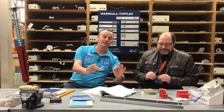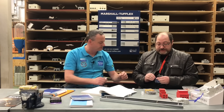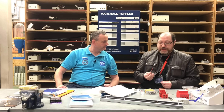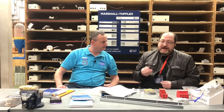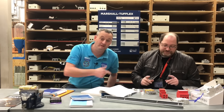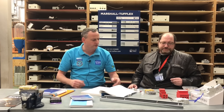If the room's ablaze and the fire officer goes in, are we expecting the plastic plug to hold up for 30 minutes? There is some research around that. The Building Research Establishment concluded that in some scenarios the plastic rawlplug will fail — they sampled it. The question is how much energy there was and how long it was present. We don't seem to have — nobody will tell you how long the system is supposed to stay up. If anyone would know that answer, he would, and he won't even tell you.